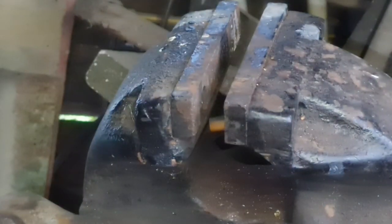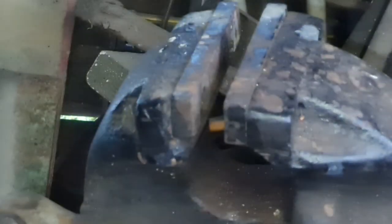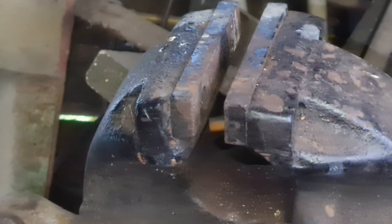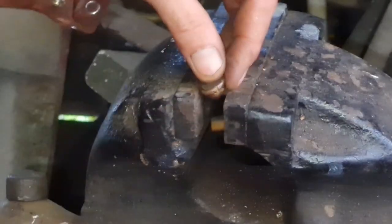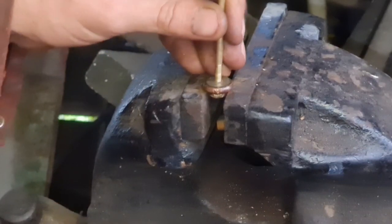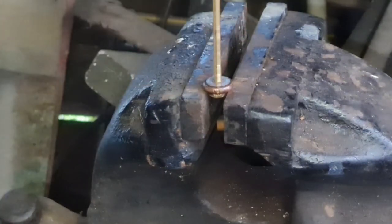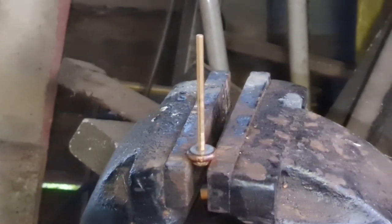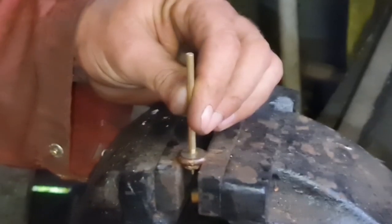So now what we need to do is replicate this by putting that collar over our new bit of brass. Let's get the bit of brass out the drill - and here is our collar. We nip the vise slightly. We need to tap that through. Can you see what we're doing there, Mr Cameraman? We need to tap this through. Look how easy that's going - that is a lovely friction fit. We won't have to solder that now.